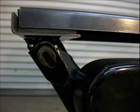So that's when you take your 4.5-inch angle grinder and clean the back edge of the frame tubes. Now do this incrementally. Let's do this in small increments because you want to have an end result with a nice flat seat tube and the seat pan sitting down, as shown in these next still images. Now the seat pan is going to sit flat on the top frame rails. And when you receive your kit, you're going to have the seat assembly attached to the seat pan. Like I said earlier, this seat pan is by itself just for reference in the video to show the desired effect we're going for.